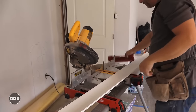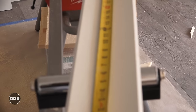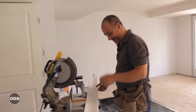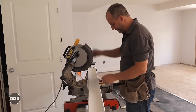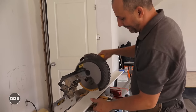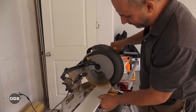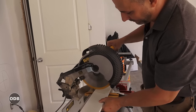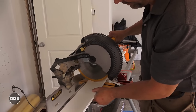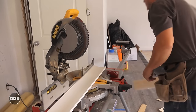Before I get into the cheat, we have to cut our measurement. Measure once and then read the measurement twice. Make a pencil line. Because it has a weird shape, generally you do enough work on the saw, you know where your blade is going to cut. Just leave itself a little open. Do a first cut and make as many adjustments as you need until you hit that spot bang on. Because you don't want to get this wrong.